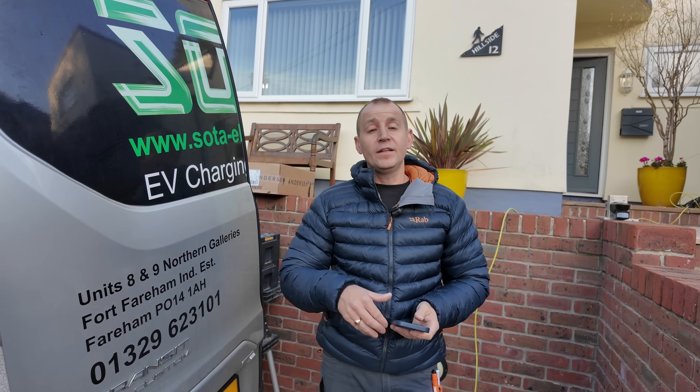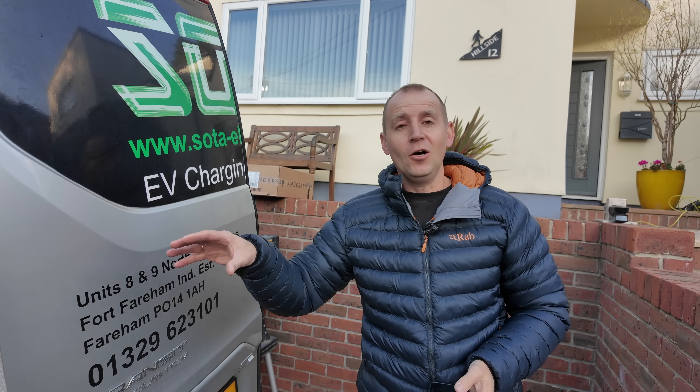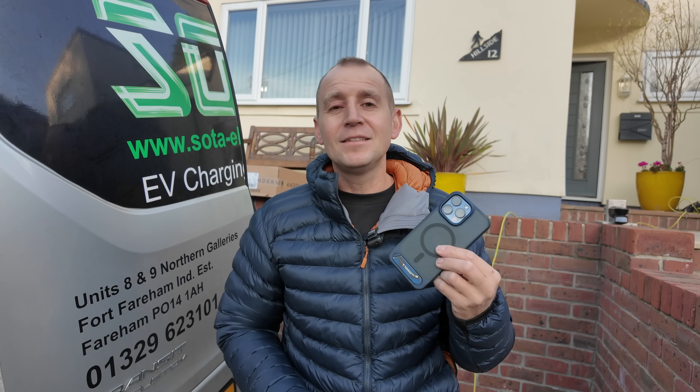One thing to check if you get an EV charger installed is some chargers only work on Wi-Fi and don't have an ethernet connection — the Anderson A3 doesn't have a hardwired internet option available. So wherever you're getting your EV charger installed, download a Wi-Fi speed test app and give it a go to make sure you have good signal. If you're an installer, I highly suggest asking your client to check the speed test before you turn up.